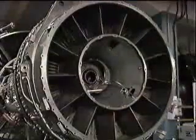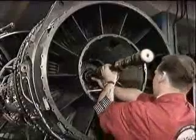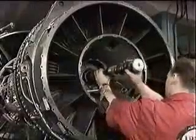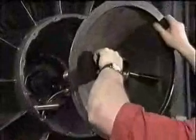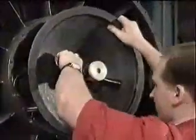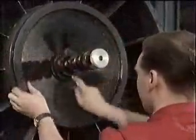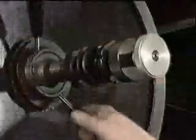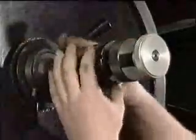Now the lifting tools can be fitted. The expanding retainer goes in first. Push it into the rear of the LP turbine shaft as far as it will go. Then turn the end knob anti-clockwise to clamp the retainer firmly in position. Now fit the protective cover by sliding it over the expanding retainer. Hand tighten and then separate the 2 large nuts on the expanding retainer.